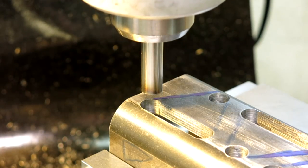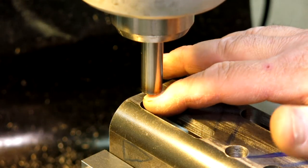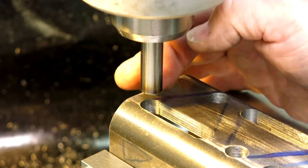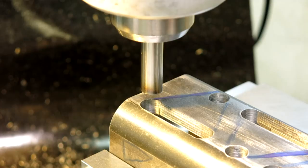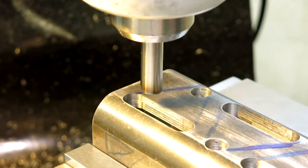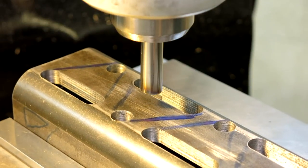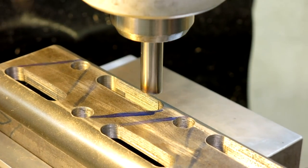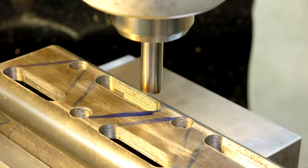And we have several cuts that are at the same angle here, okay? And once we zero out on here, this is where having a good CAD layout and setting your angles accurately makes a difference. Because now I can just cruise over to a known dimension, okay? And get into my next hole. Now, I don't remember what the number is, but 948. Something like that.